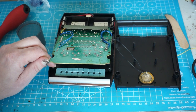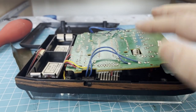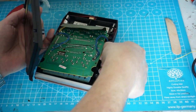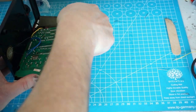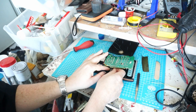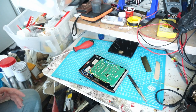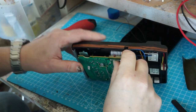This is the moment that I notice it — why is that ribbon cable flopping around? You can really see that it's only partially in there. And there's a red bodge wire that is actually from the factory, not the previous owner. It just came out. So I have to undo all these wires in order to get to it because it's really a tiny, tiny space. Here I'm wrestling to get it in, but the slot is just too narrow, too small, and my fingers are too big. It's really poorly designed. It took me five minutes, honestly, and a lot of cursing.